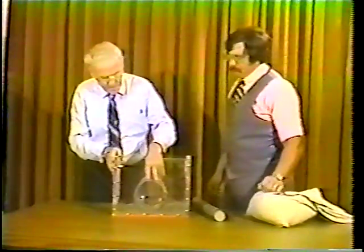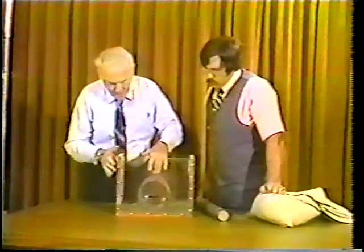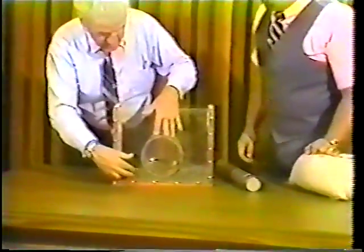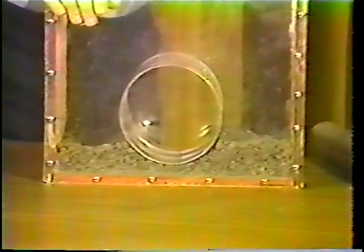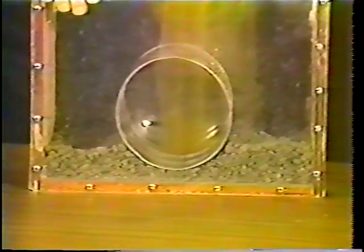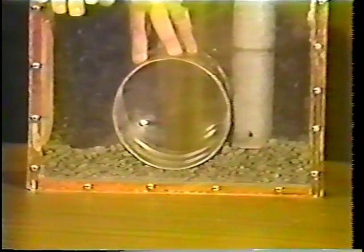Now, what we have done here is empty the old material, the non-compacted material, out and put in a cushion, a bed, if you will, for the pipe to rest on. We've already compacted this side by using the Proctor hammer as a simulated whacker or hand tamper, whatever. Andy, can we compact this side? And I think you can see that there is a noticeable change in the level of the material. I'll hold the pipe. Okay, Bob, here we go.